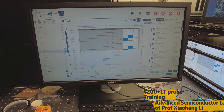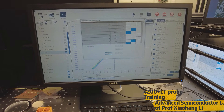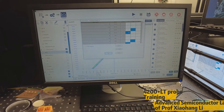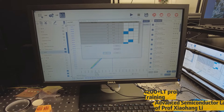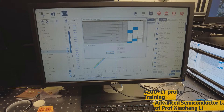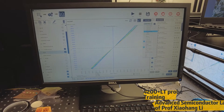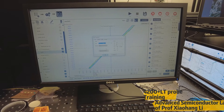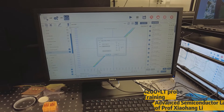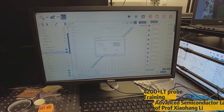In the defined graph, you can see there are multiple options. Fundamentally, we only choose two: either BI, BV, AI, or AV. From the configuration window, we know we have A and B, so we choose x-axis as voltage and y-axis as current — those two parameters to measure and plot. After selecting them, we click okay. Then in axis properties, we know we've selected some parameters but we need to choose the plot type: either auto scale, log scale, inverted scale, or absolute scale. We can set all axes to auto scale. This is the brief overview of graph settings.